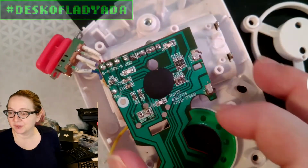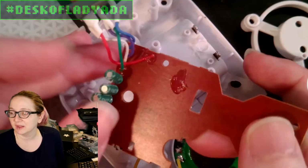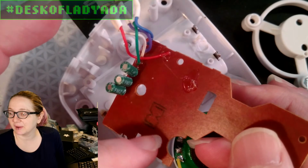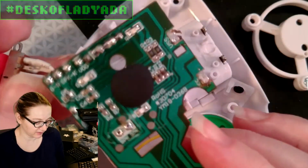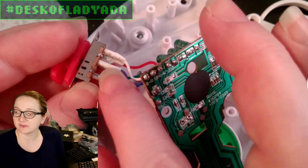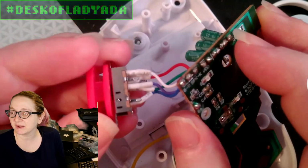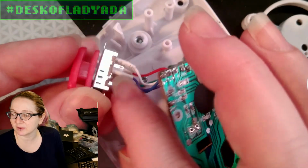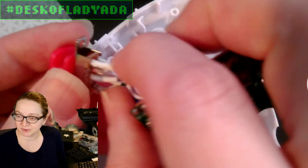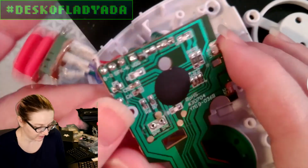So we took this apart and there's a couple of little details that make it very nice. Like there's hot glue used as strain relief on the wires and on this switch here that changes modes and turns it on and off. First off, it's a fairly nice switch, but also they used heat shrink because this is exactly where, if it gets bent or shaken or vibrated, these solder joints are going to fail.